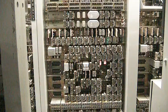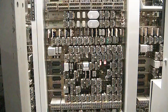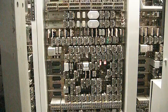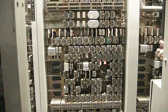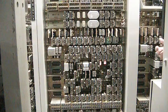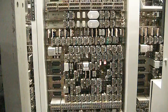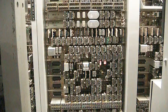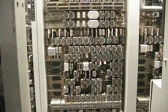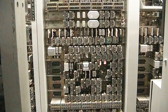If you dial 0 and a 10-digit phone number, of course the originating register receives all of the digits. At the end of the 7th or 10th digit, the marker comes in, looks in a route relay, which is 20 route relays within the number 3 crossbar system, and determines that it needs to be set up on a trunk, which is an operator trunk, to the TSPS office. Then it would send the number you dialed as well as the number you're calling from. That would be done in multi-frequency.